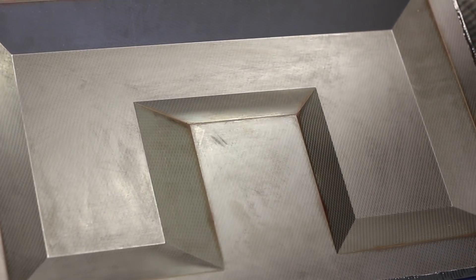We cured these parts and compared them to ones made by hand — we're achieving the same, if not better, quality than can be done by hand. This is the first time that a sheet of prepreg has really been laid onto a complex mould in the same manner as hand lay-up. The next stages are: A, increase the speed so the robot can go faster; B, add feedback to detect wrinkling or other quality issues; and C, include a robot to take plies from the press and move them to create a more full production line system. This has been a successful project, and we're currently looking at creating an existing part for a large aerospace company.